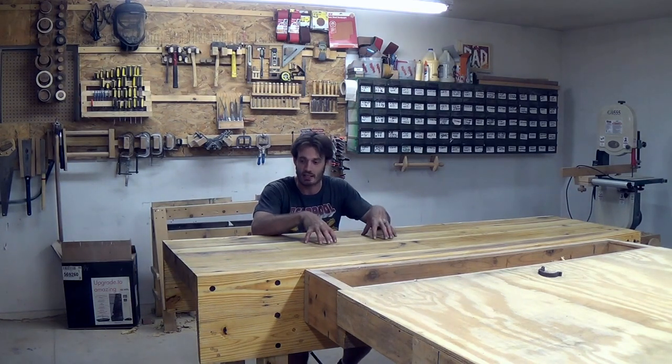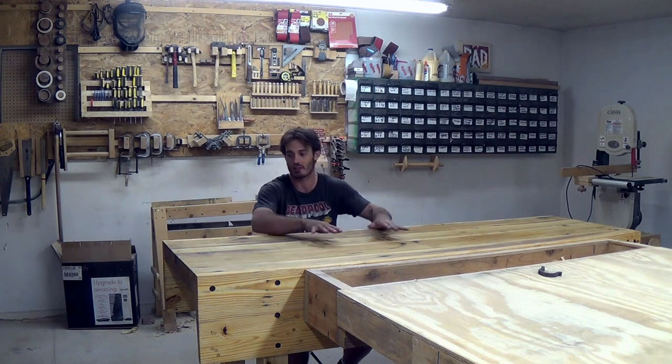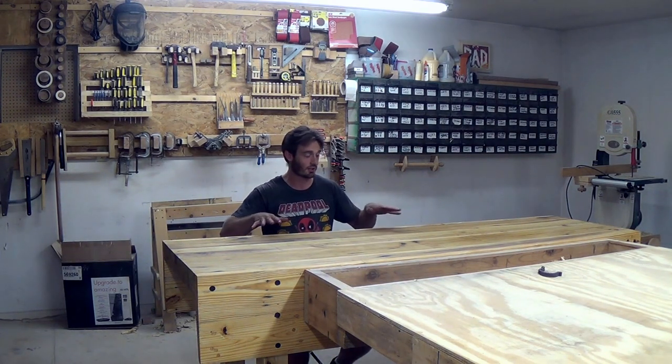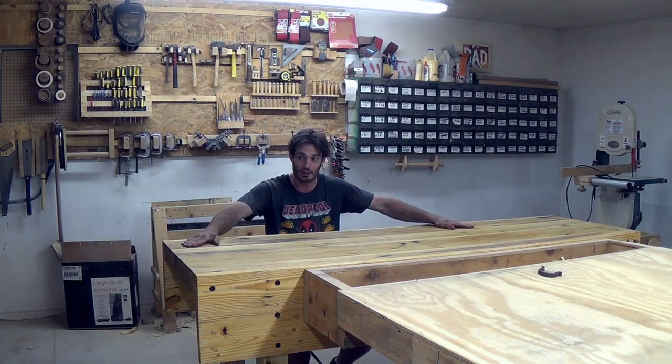One thing to note, when you're building a bench this thick, over the first two wet, first two dry seasons, you're going to get a lot of warping in this. No matter how you build it, if you're going to build a solid top table or bench, it will always warp and twist on you. So I didn't worry too much about getting this thing perfectly flat. Believe it or not, it'll actually take about 2 years for this entire thing to finish warping and twisting so that I'll come back, re-square the legs, re-flatten the top, and at that point, the bench will be done.